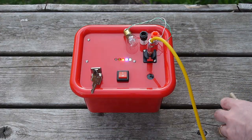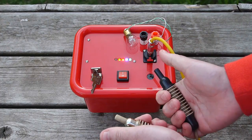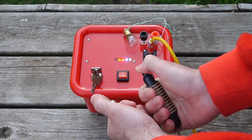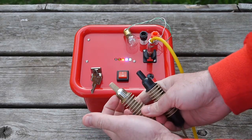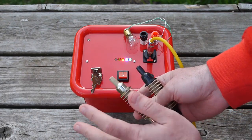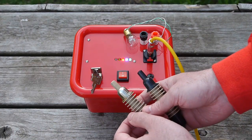In this position it will launch — let's launch again. Oh, I let go early. Well, in that case the launch just starts again. In this example I let go really quickly of the launch button, and therefore it didn't power the igniter the whole time, which is fine. So if you as the operator know that the launch has occurred, you can just let go and the igniter will stop lighting.